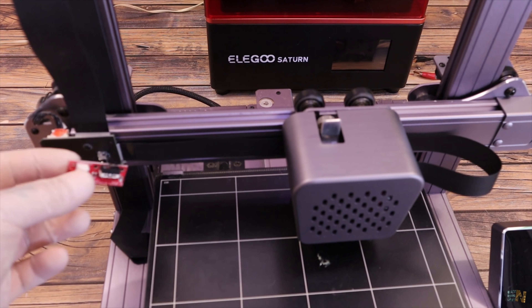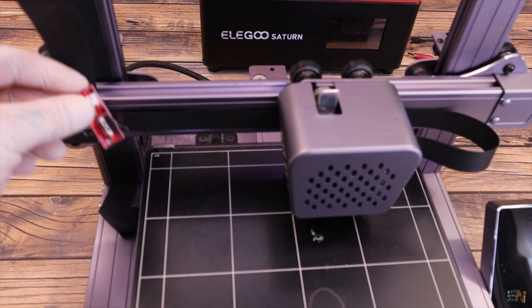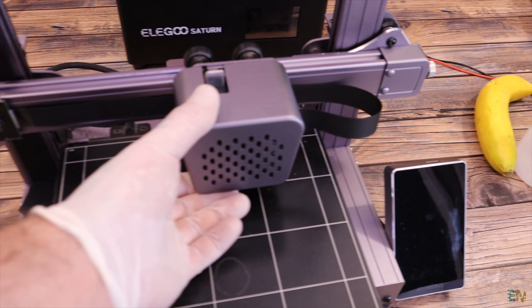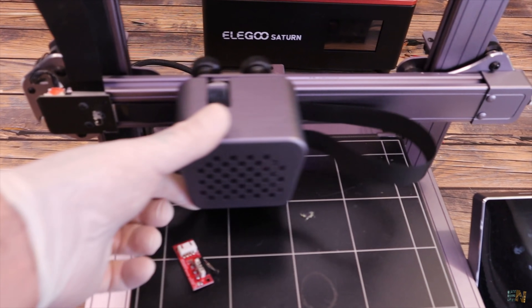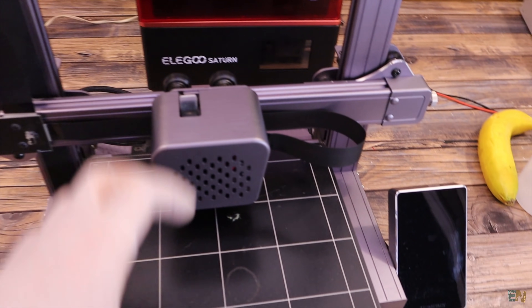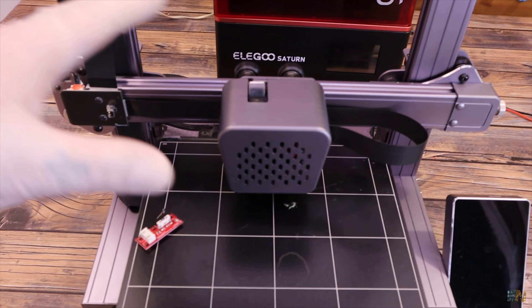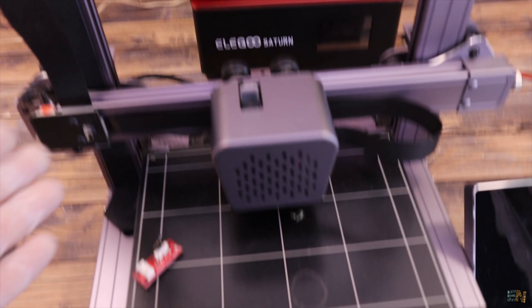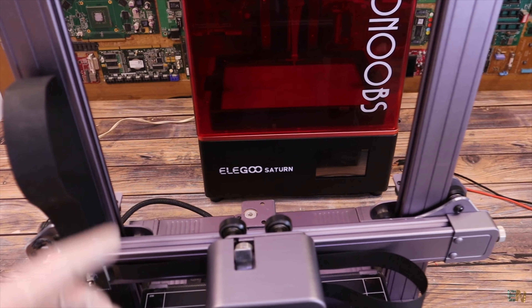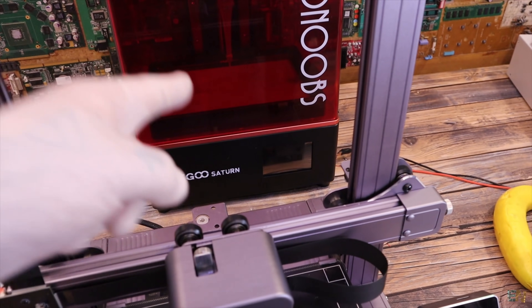Let me show you how you would do this with a normal FDM printer. With a normal FDM printer, what I usually do is place an endstop switch on this axis and add a small G-code that makes the printer go to position 0,0 after each layer so it touches that button. When it touches the button it takes the picture — the print is always in the same spot, so it moves gradually upwards and you get a cool timelapse. But with the resin printer we don't have that axis to touch the button, so we need to activate the switch using the UV light inside the printer.